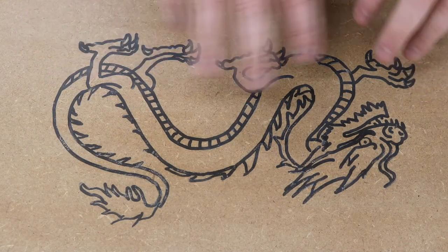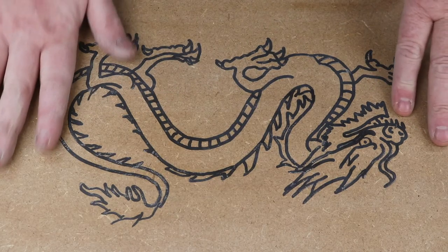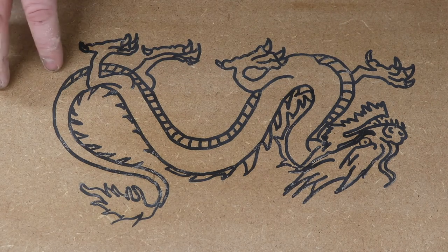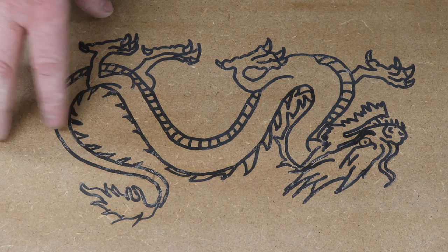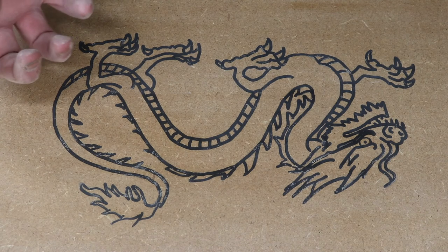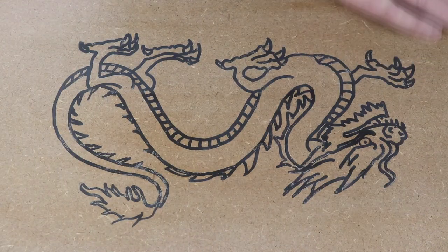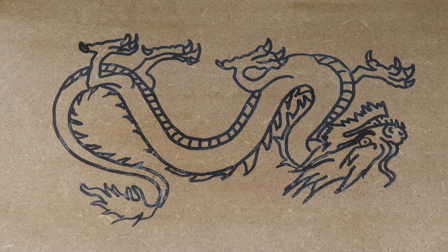That sanding sealer is now sanded down to 600 I sanded it down to. Very, very smooth, and I don't think I told you why I put cellulose sanding sealer on, it's because it dries very quickly because of the makeup of it, and so the moisture doesn't really have that long to take hold and to warp the board, and so I think it's an ideal thing to put on MDF to seal it anyway.